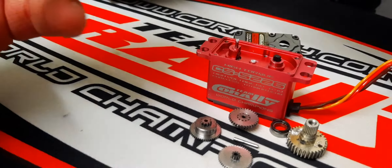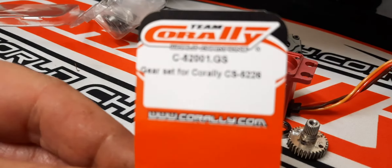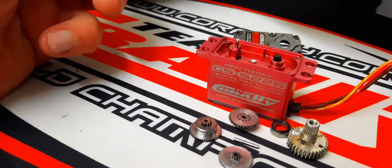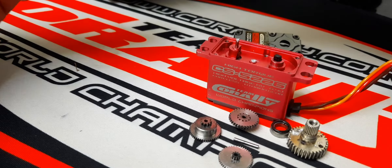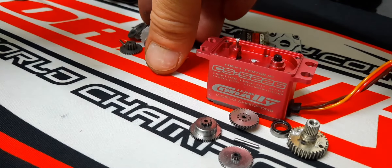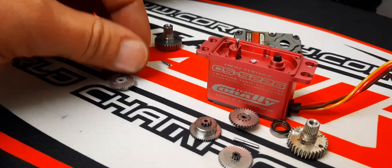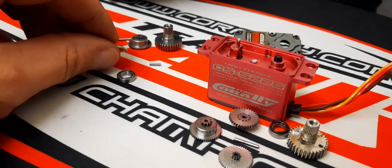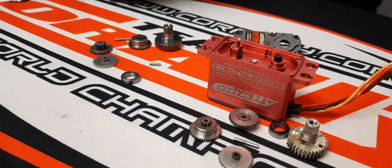The new gear set comes with everything you need except the screws, so don't lose them. That's what's good with buying a quality servo like this — you can buy spare parts for it. These are all the nice titanium parts. There's an open bearing so I assume the open side goes down so water doesn't sit still in the bearing.